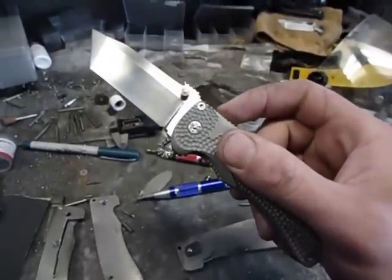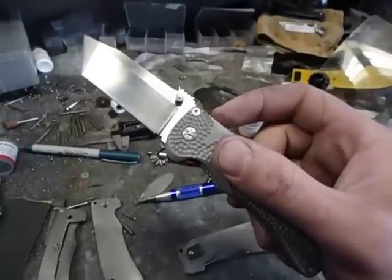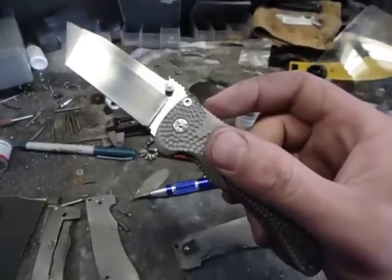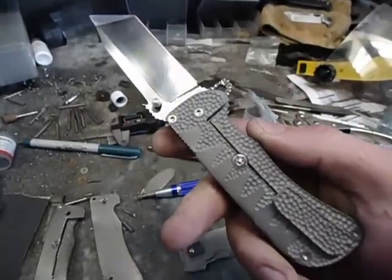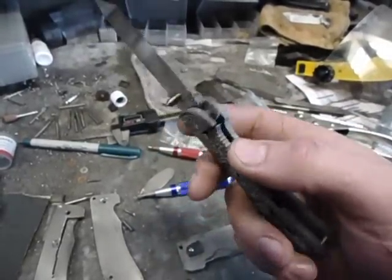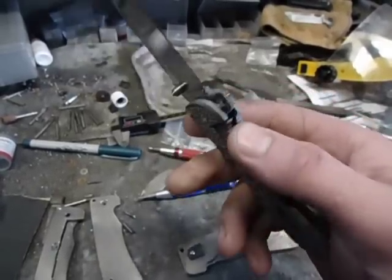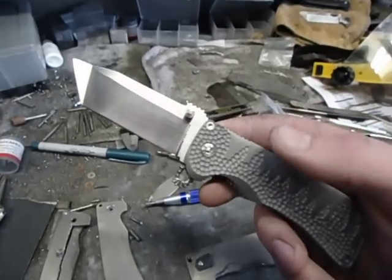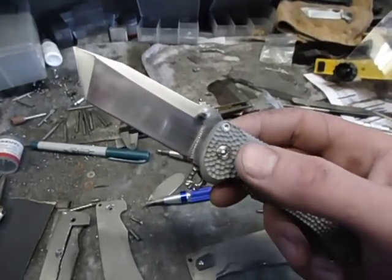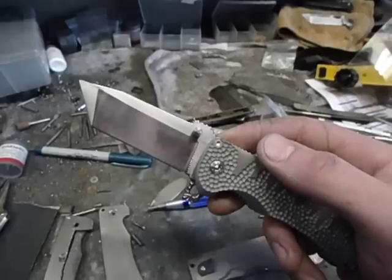Yeah, this particular design, I do not ever have the problem of trying to flip it and flub it in the first opening. They seem to fly. The original just had a standard ball detent, and it functioned just like this one does. So they always fly out. So I've done something right with the ratios on this particular knife design.